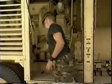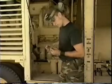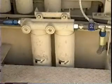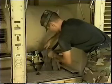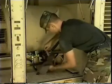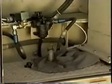Verify the engine oil and radiator fluid levels and service as required. The fuel filters and strainers must also be checked. The fuel strainer elements may need to be cleaned more frequently than the TO recommends. Condition of the fuel being used will dictate this interval.